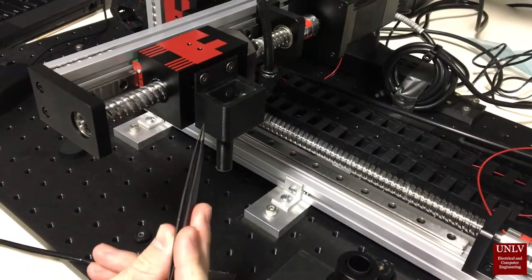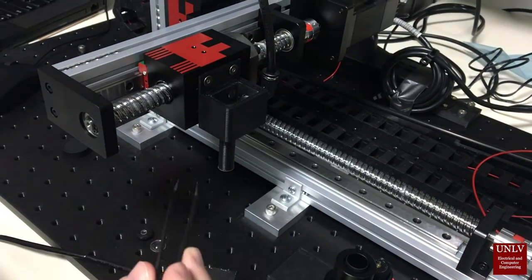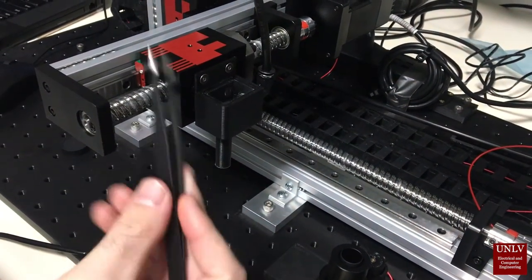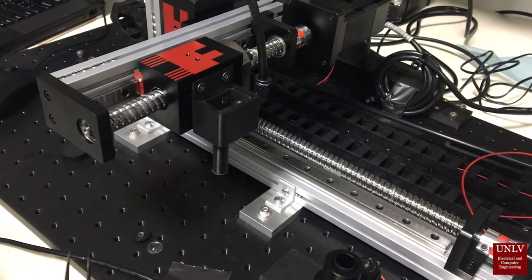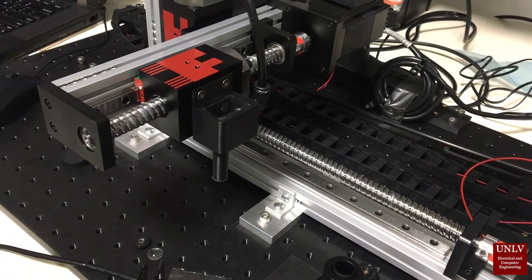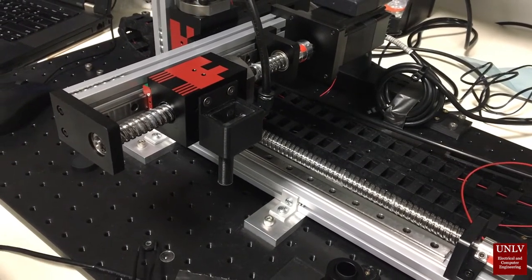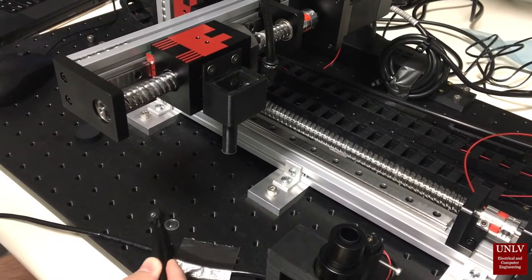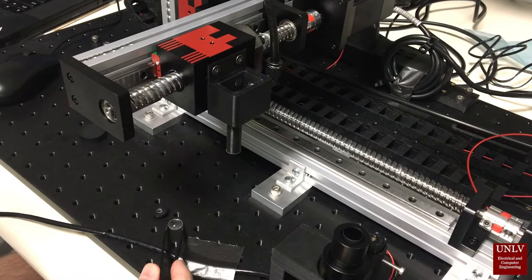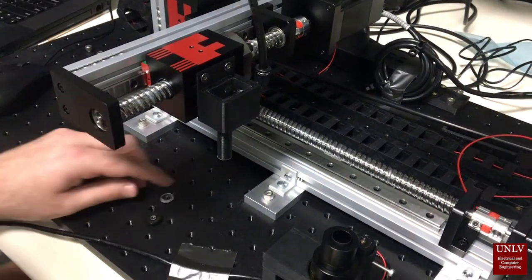Okay, here we have our lens housing unit. You'll see that we epoxied a glass slide on top of it so that the laser diode light can actually get up through the housing unit, and it's airtight so that the vacuum pressure remains when we attach a lens to it. We have actually two different sizes of lenses that can be used for the unit. This little tiny guy here and this big one here. And you'll see that there's no pressure until we actually flick the unit on.